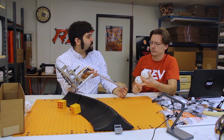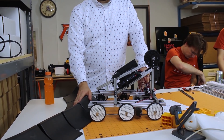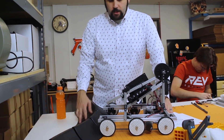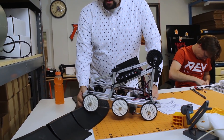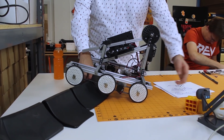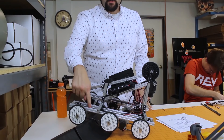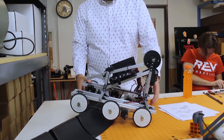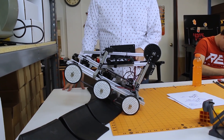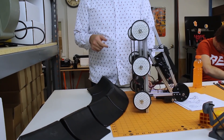This is a standard six wheel drive drivetrain using kit wheels — the type of drivetrain you can build from our kit. This is the crater wall, and what we want to show is that if you build a chain drive with the wheel exposed and go up to this, you can actually pretty easily get up and over it. But this is where the challenge comes in — you can see the chain is rubbing right on the top of the crater and that's an issue. We think we could route that chain higher using an idler sprocket. But then the next thing comes into play: if you keep driving forward, once you get that center wheel to engage, unless your robot's center of gravity is way far back or way far forward, continuing to drive forward you're going to end up on your back. Center of gravity is actually going to become one of the biggest challenges with drivetrain design.